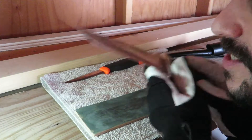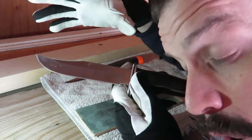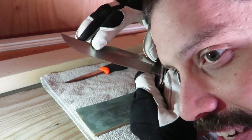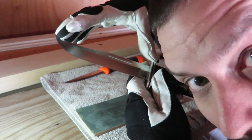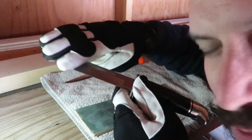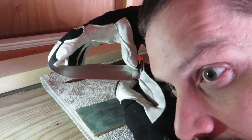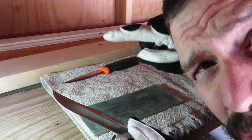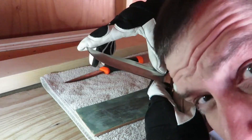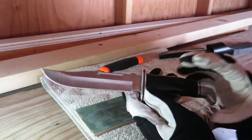Now why is that? Stainless steel is made in combination with about 18% chromium. Chrome, just like the bumper of a car, resists oxide. Rather than the iron interacting with the air and creating iron oxide, the chromium interacts with the oxygen and protects the steel, creating a layer of chromium oxide. The chromium protects the blade from oxygen. It also protects the blade from the oxygen dissolved in water, so it doesn't rust. It stays bright, shiny, and beautiful for the life of the blade.